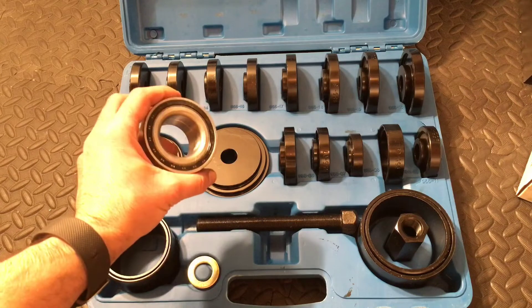Everything is pressed in all the way. So now on this side here, we're going to go ahead and put in this retainer ring — that can just be pushed right in. I'll go ahead and get some pliers and press that in. Here's a close-up: you can see the bearing in place, you can see the retainer ring is clipped in, everything is nice and secure. So now we can go ahead and flip it over, put a little bit of grease on the hub shaft, and press that into the inner part of the inner race on that bearing. And that will wrap up this video for how to press a bearing.